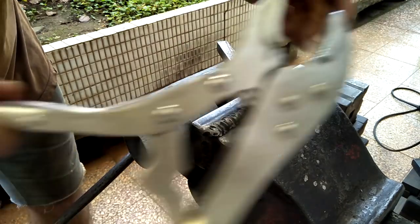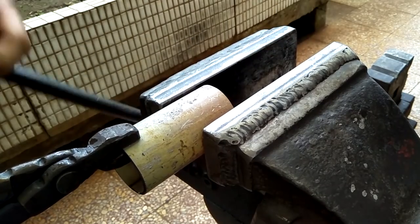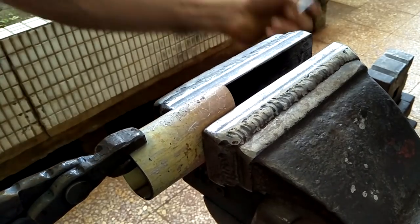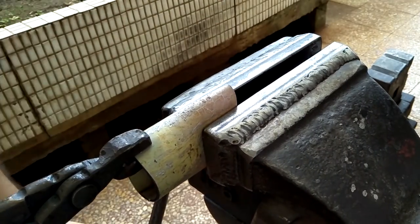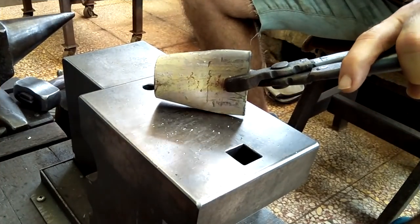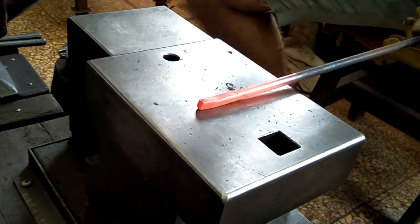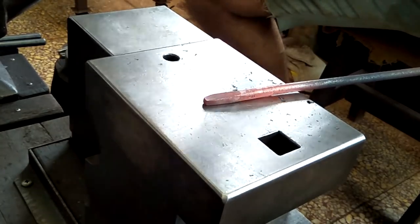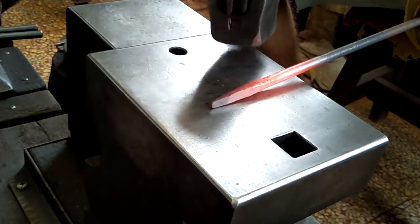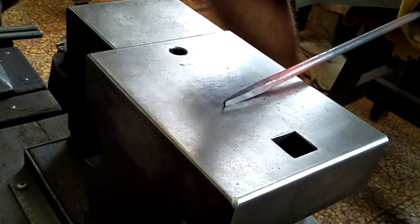I want to give a very big shout out to Donald C. Henley for his very generous donation and for his multiple purchases — thanks a lot. I squeezed a little too much of this short section of pipe and it tapered the rounded end, but all this means is that after I form a hook over it, I'll just have to take one heat to straighten it out and get it back into one plane — not a big deal. One other thing: if you heat a galvanized pipe, make sure you're in a well-ventilated area.